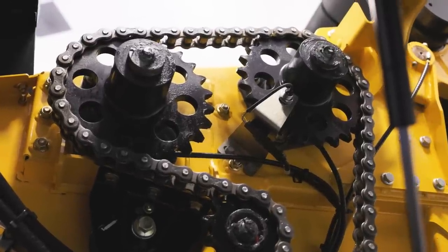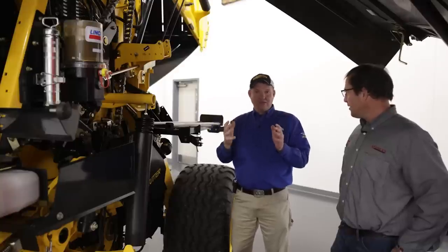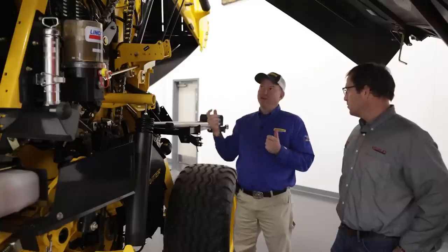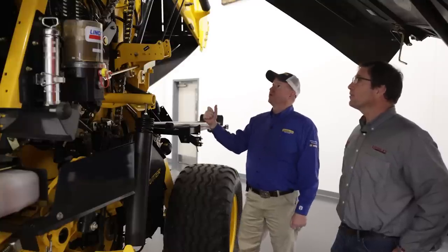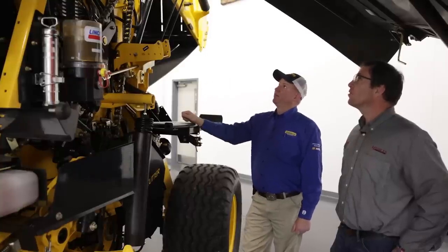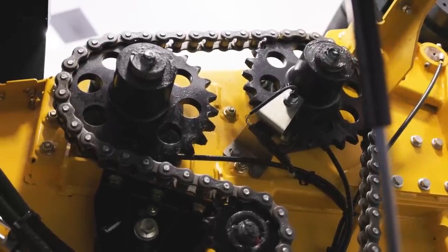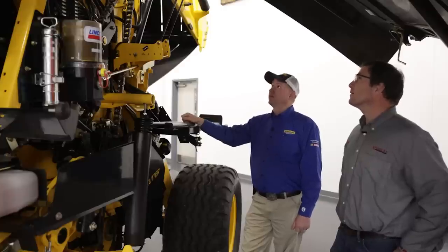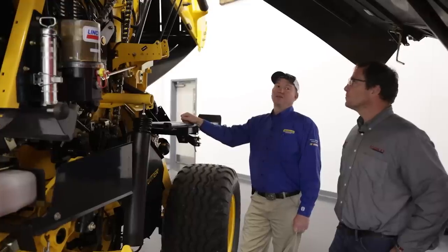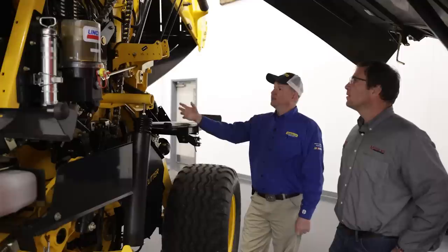Let's talk about the size. When you have a larger diameter anything turning, it slows down — it turns slower. By turning things slower, we're increasing the longevity of the life of the parts of the baler. It's all about more uptime, no downtime. Look at the chain contact on those sprockets — it's wrapped around the front sprocket almost two-thirds of the way around, and even on the back sprocket. A lot of contact. When you have a lot of contact with that sprocket, you're spreading the wear and tear of that chain. And we're not bending that chain around a really tight angle, which also increases the life of the chain.